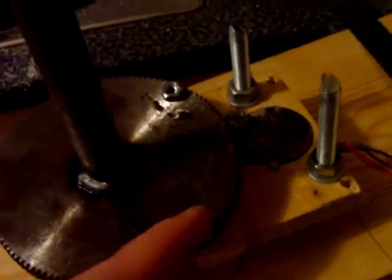Let me show you how this works. This stepper motor here goes to these ULN transistors here. These ULN transistors are motor drivers — they take a small signal in from the Arduino.